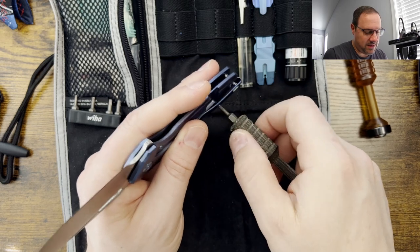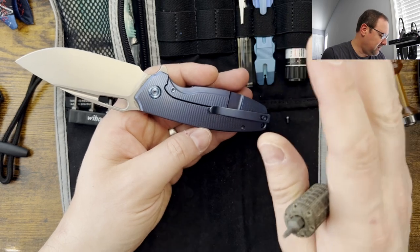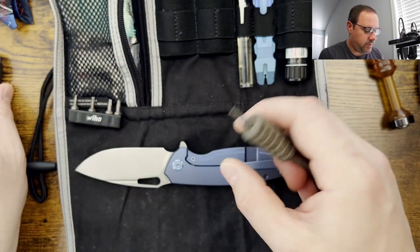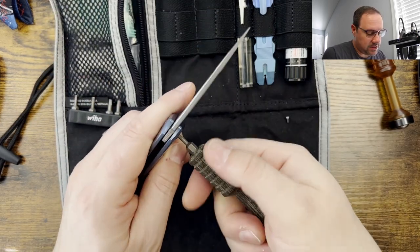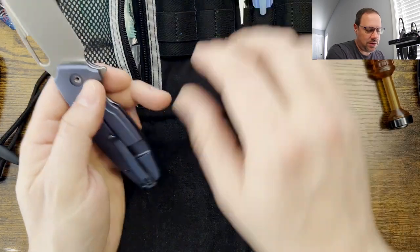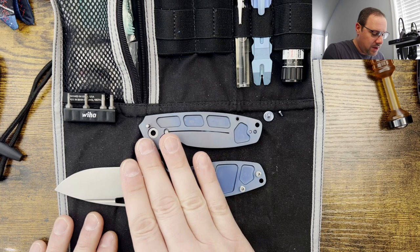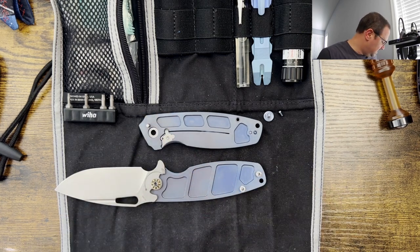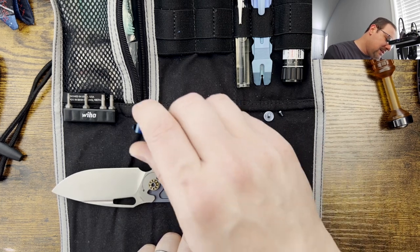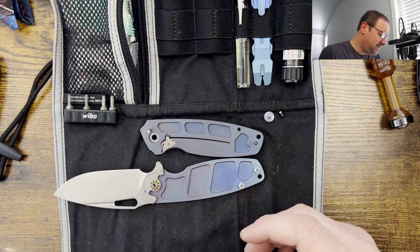The tolerances on these bolts are really nice — they fit very snug, but my complaint is they're a little shallow, so it's working on the very tip of the hardware. Civivi does a really good job with these; even on the older Praxis it goes in just a skosh deeper into the head, which I really appreciate. Let's go ahead and get this apart. It would be up to you if you want to install Skiffs on this knife — you very well could and you're going to see a slight improvement on the action, but it really isn't going to need it. So it's a very simple construction. You can see you've got your lock bar insert, your washers, your stop pin, your standoffs — which I said we would check to see if they're steel. Wow. They're not steel — they are titanium standoffs. They just chose not to anodize them, which makes this even more impressive for the money. That is bananas.